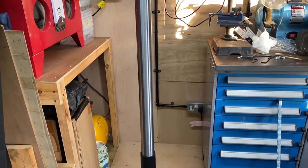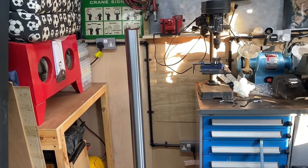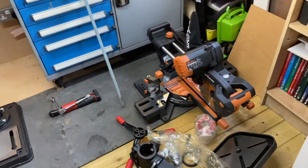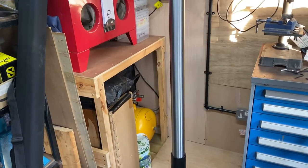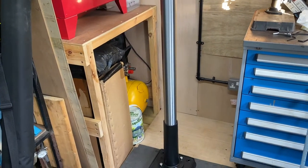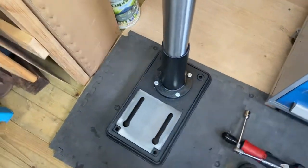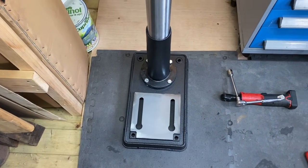That's where it's going to go - a few other bits to clear up and get out of the way. There's my old bench drill, it's been going for years. It comes well packaged; the tube is covered in oil just to keep it protected. There are a couple of grub screws around the back down there that hold the tube into the base pole. Four bolts - 17mm I think - with spring washers on them.